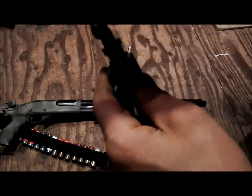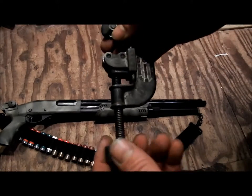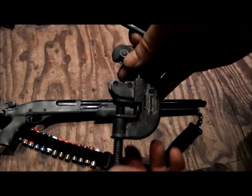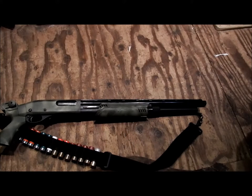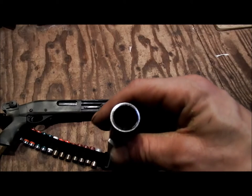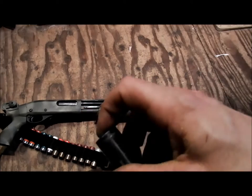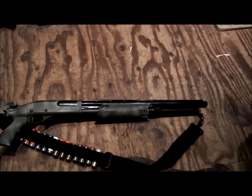Once you've got the score, you keep tightening the handle as you spin it — a small quarter turn tighter, a couple of rotations around the pipe, tighten again, repeat until the pipe is cut through. Then you have to get that burr out. As you can see there's a real nasty burr right where it's cut — it curves inward and creates a sharp edge on the inside of the barrel.